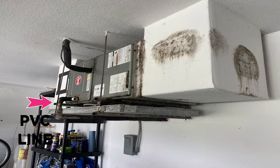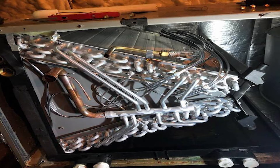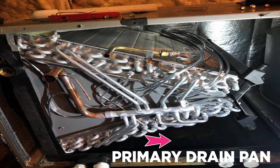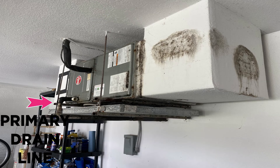That has water. You'll see a PVC line coming out of the unit. When the air blows across your evaporator coil, the water that is inside of the air, as it blows across that cold coil, condenses onto the coil and drops down into a pan called your primary drain pan. That has a line called your primary drain line, a PVC line connected to the pan.